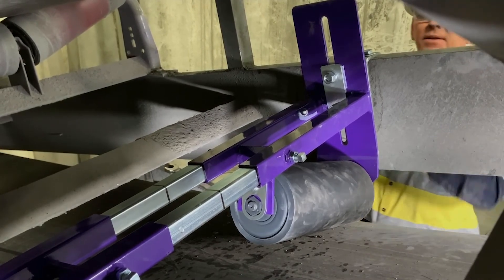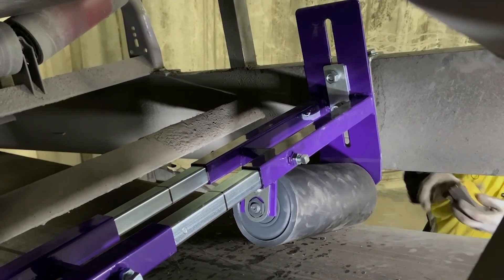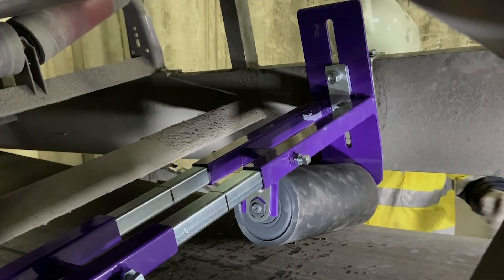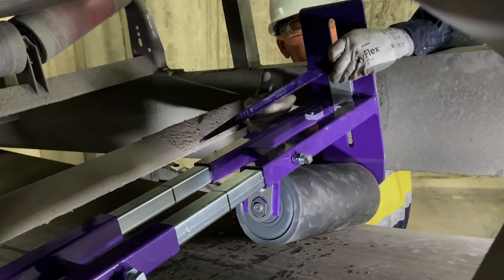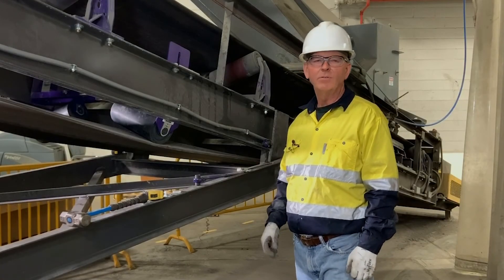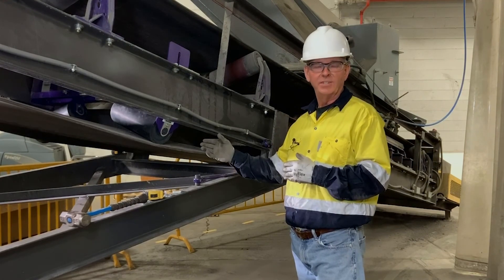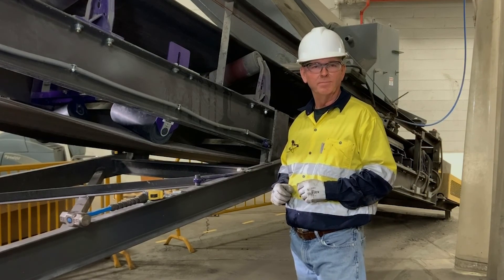If it's off a little bit, we're going to gently tap until we have our six inches of contact, then tighten the nuts. If the desired results were not achieved with the initial setup, incremental adjustments can be made by increasing the roller-to-belt contact on the side the belt is walking to, and if necessary decreasing on the off side. We've now completed the installation of the RBP1 belt positioner.